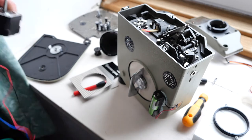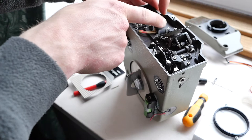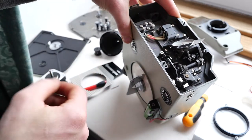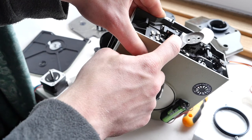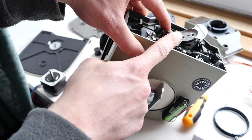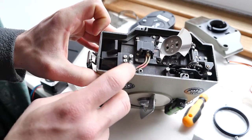This piece here is a ground glass — that's where the image for the viewfinder is focused, right on the bottom there; the mirror focuses onto it. To the side of that we have the CdS cell, which is a very light-sensitive sensor that sits to the side of the ground glass, and that's for exposure metering.